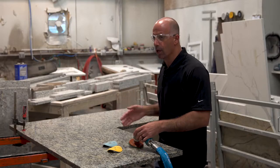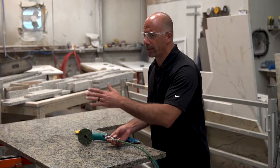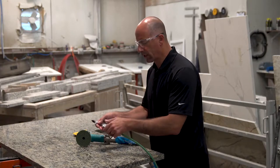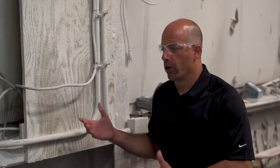Most facilities have a blow gun that goes along with every grinder. Making sure you have an adequate number of air piping connection points throughout the facility means you don't have to keep unplugging one tool and plugging into another. This keeps things seamless and keeps the guys working a lot more efficiently.